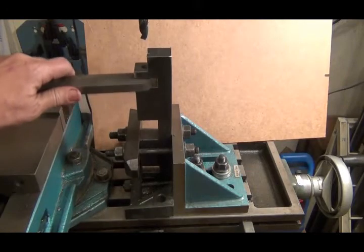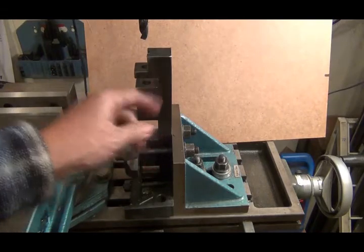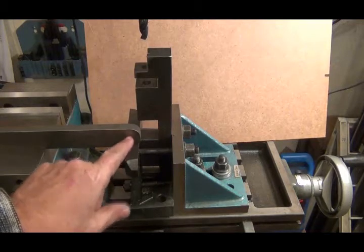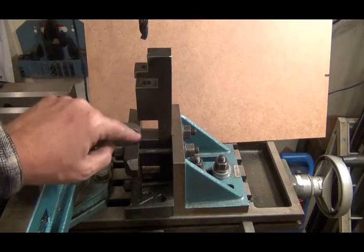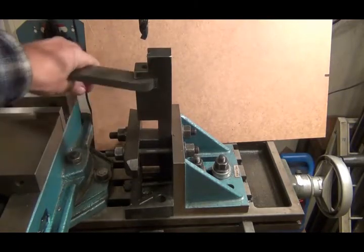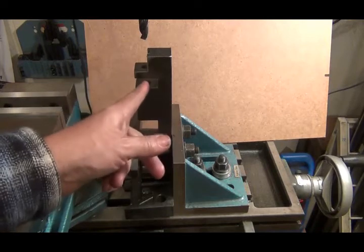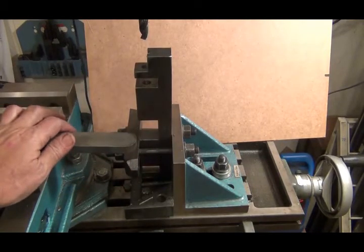What this is, is where the swing arm right here will fasten in here. I came back from here half the thickness of this so I can have a half-inch hole right in here, and then the pin will go down through here through that. There will be room for this to swivel without rubbing in the back — I think I gave it five thousandths extra clearance out this way.